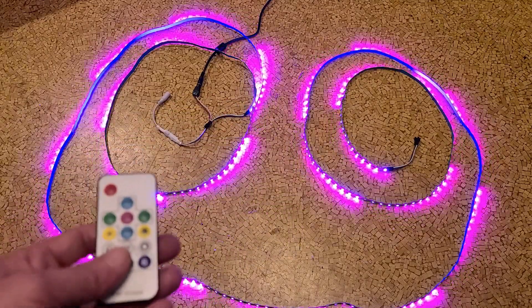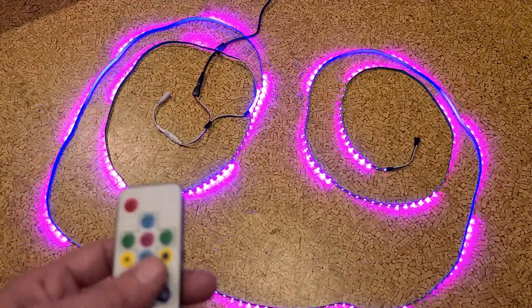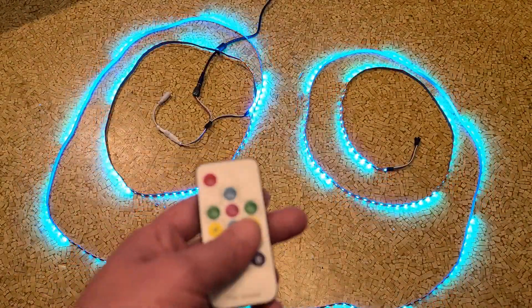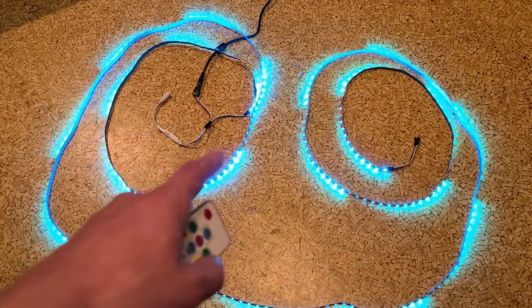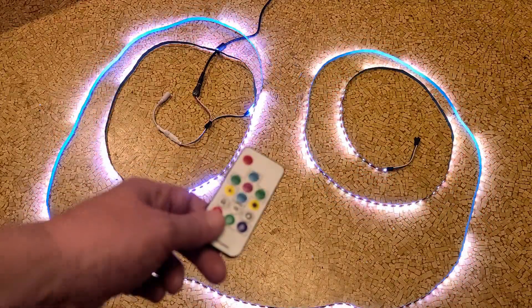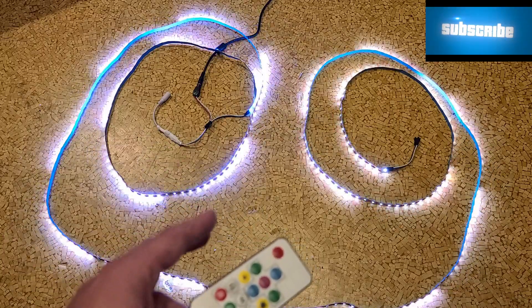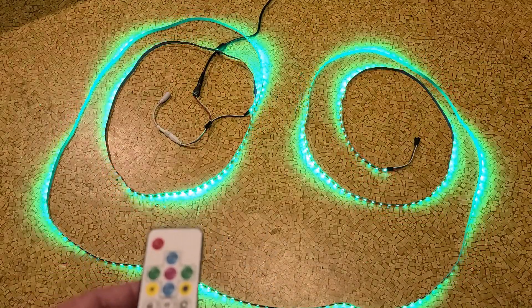These are the really cool dream color ones. When you get these, you get 300 modes. If you're technically inclined, you can actually reprogram them. These are the strips that can be cut, and with this particular controller you actually have a setting button, so when you cut it down you can reset it so it's still controlling the appropriate number of LEDs. These are like five-eighths of an inch apart — 300 LEDs in the strip. These are the basic unprotected ones, so it wouldn't be recommended to put them outside, but they make ones that are slid inside a silicone tube or have another coating. These have an adhesive back so you can stick them places.